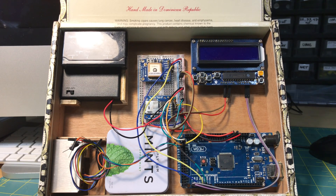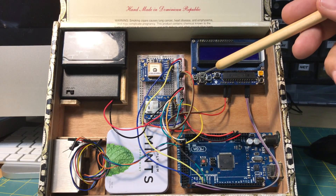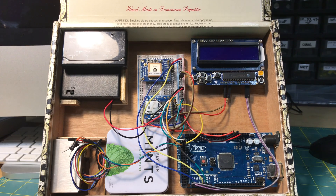So it makes it a lot easier if you want to hook up multiple pieces of hardware that talk over UART. As for the other hardware, this little SD card reader runs off the SPI pins on the microcontroller, and the LCD is talking to the microcontroller using I2C.